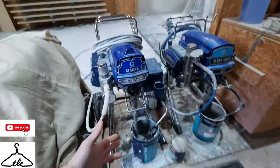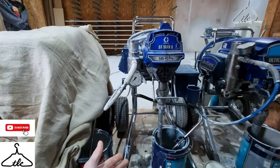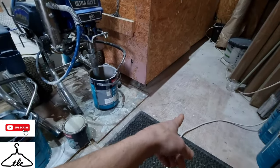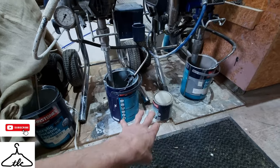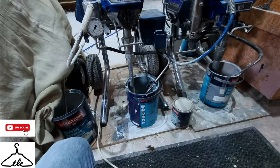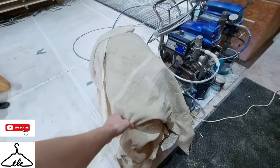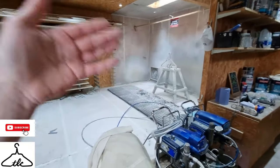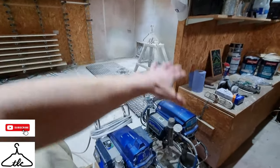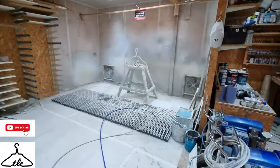Just below the sprayers I use Corex or some boards because you will get spillages when taking the filter lids off. I've got Corex covering the whole floor — it's been down five years, it's white to reflect light, and if I spill paint I just wipe it up. The two MDF boards under the sprayers are absolutely covered in paint and do a great job protecting the floor. Always cover your sprayers with a thick heavy-duty blanket — they're expensive machines and you don't want overspray landing on them.